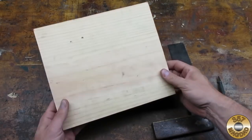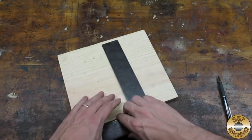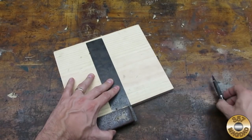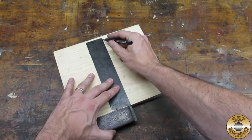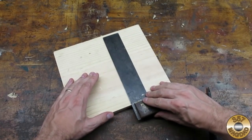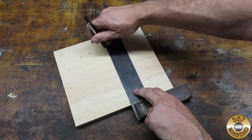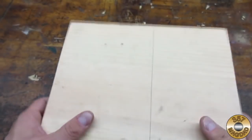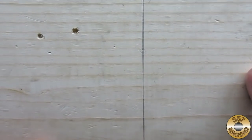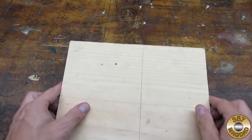The first thing I did was check for squareness. I cut a piece of scrap wood on the table saw to make one edge dead straight. I used a mechanical pencil with fine lead to trace a line, then flipped the tri-square over and made sure I was on the line at the edge, and traced another line. The two lines diverged, meaning the angle between the brass face and the steel blade was not exactly 90 degrees.